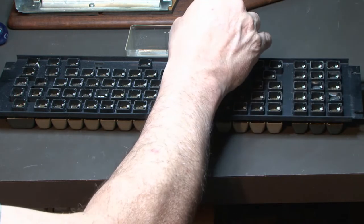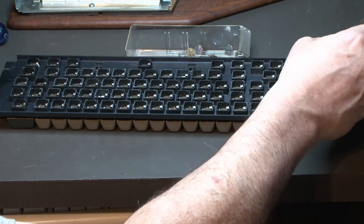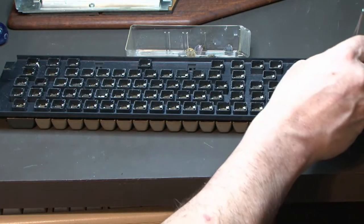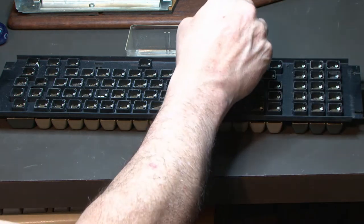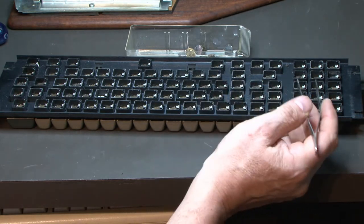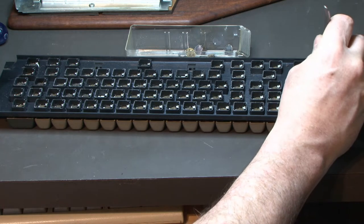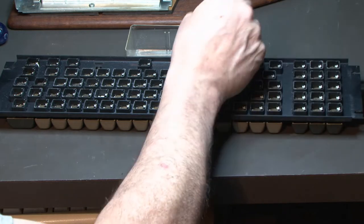Well, it's near the top, but I don't know, they could have put it up in, well, E is where the floppy interface works. F is really nothing, so that's empty, you can use that for user RAM, and D for user RAM. So why they didn't put it higher up, I don't know, there must have been some sort of reason. Maybe they figured you never need more than 48K of RAM, because back in 1975 and '76, that was a massive amount for one of these 8-bit computers.